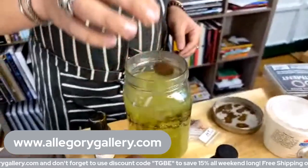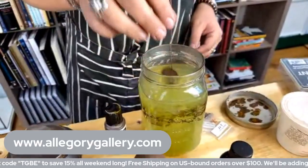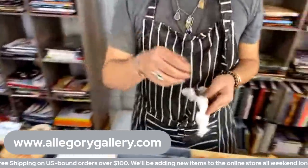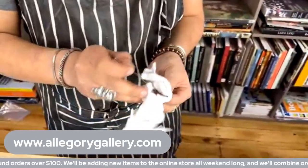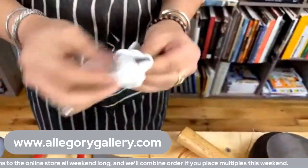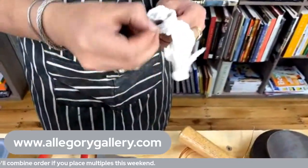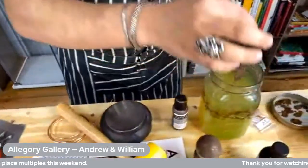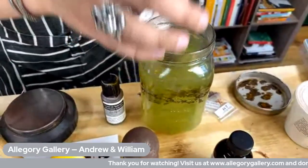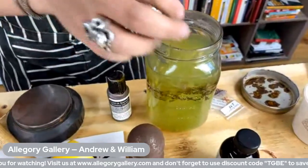Now, if you really want a super dark copper patina, after you're about midway, you clean off whatever patina has started and do it again. Basically, you're freeing up that surface area so it gets more surface contact with the liver of sulfur and you get a darker, richer tone. You'll just keep doing that until it's as dark as you want.